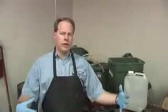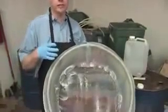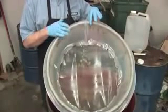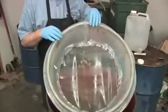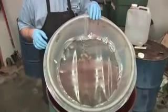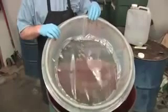Once we've brought our oil into our warehouse, we have to filter it. In order to make biodiesel, it's a really good idea to filter it down so you get your crusties and crunchies out. This is just a 55-gallon drum strainer. It's a 400 micron. It's the one we personally use. It looks kind of gross and yucky, but we've probably put about 3,500 gallons of oil through this filter. So they're pretty durable and they last long.